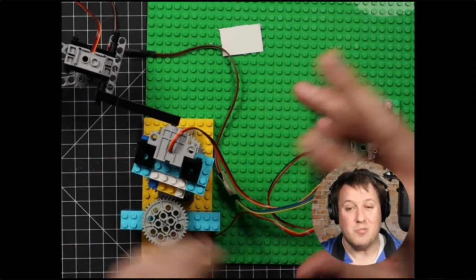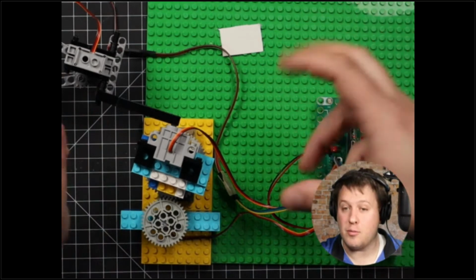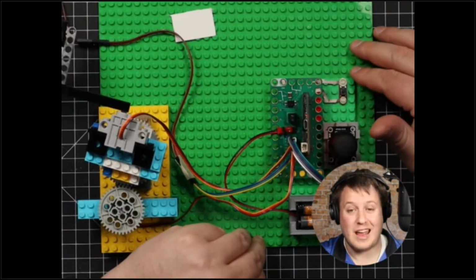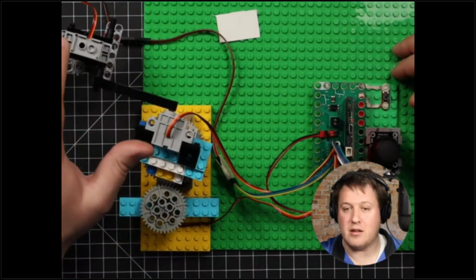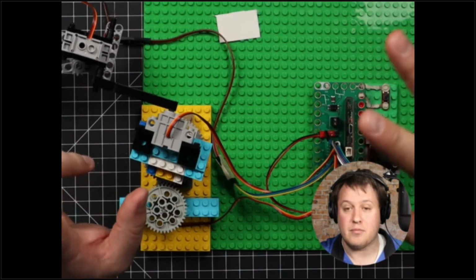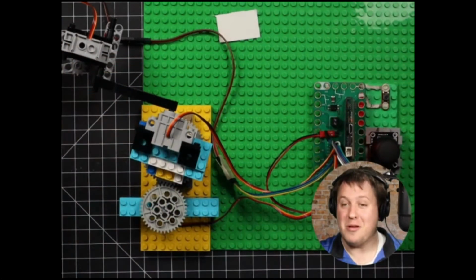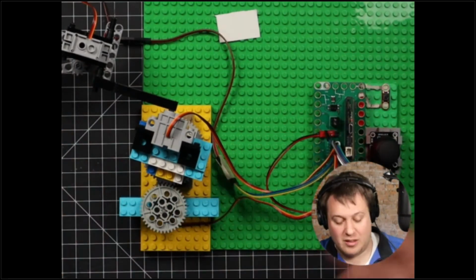The big issue is most robot arms typically use 4 servos to work: X, Y, Z, and then a grippy. Unfortunately, the micro:bit, just as a hardware limitation, maxes out at 3 servos it can actually handle, but that's also a ton more weight for the pieces to handle in a Lego environment. That, again, just gets more and more complicated as you go along. So the electromagnet ends up being a very, very nice solution for making a real piece of machinery that would exist in the real world to move objects around, say, an open area like in a factory, machines that just move things around on a conveyor belt, in a classroom setting with only a few Lego pieces. This isn't really complicated at all.